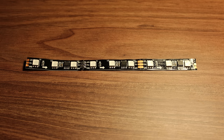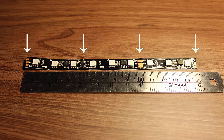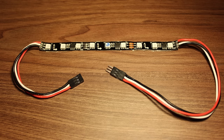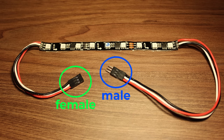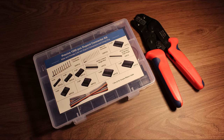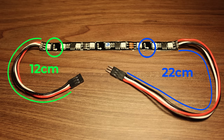We need to cut the LED strips into sections that are roughly 15cm long to fit in each segment. Make sure you only cut using the cut marks that are on the LED strip. To connect one LED strip to another in a different segment, we're going to use wires with female and male DuPont connectors on either side. DuPont connectors are connectors that you can easily make yourself using a crimping tool, and they make your project much neater. The female side wires need to be 12cm long and the male side wires need to be 22cm long.